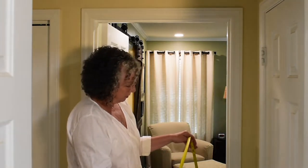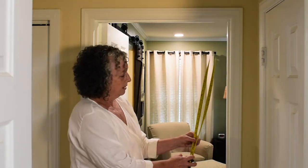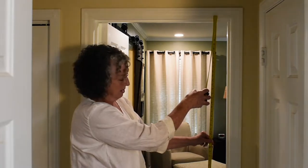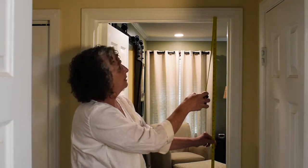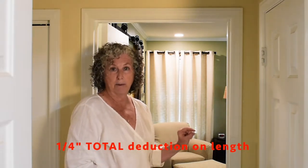As far as the length measurement, what I do is start by putting my tape measure down on my sill so I've got a little stopping point, and then I roll the tape up until you get to the top of your window. That's the most accurate way I've found to get your length measurement. You're going to want to do that on the right and on the left, take the shortest of those two numbers, and deduct about a quarter of an inch. A quarter of an inch gives you just a little bit of space between the bottom of your shade and the window sill — you don't want your fabric touching the sill because you're going to get dirt, moisture, and condensation on it.